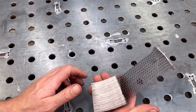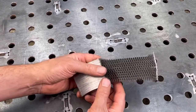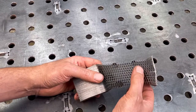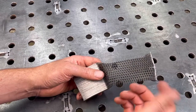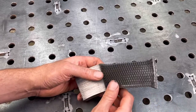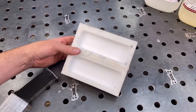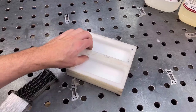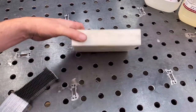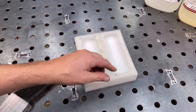So what I'm going to do first is I'm going to pull some out and I'm going to get a mold — something I've machined — and I'm going to use that inside so I can put some epoxy in it. I'll put some epoxy with some coloring or some flakes or something like that, and I'll show you how I do that. For the mold, you can 3D print one — just got to make sure you have enough draft on it so you can get it out. This one here is some Delrin material, so it's a non-stick material to epoxy.